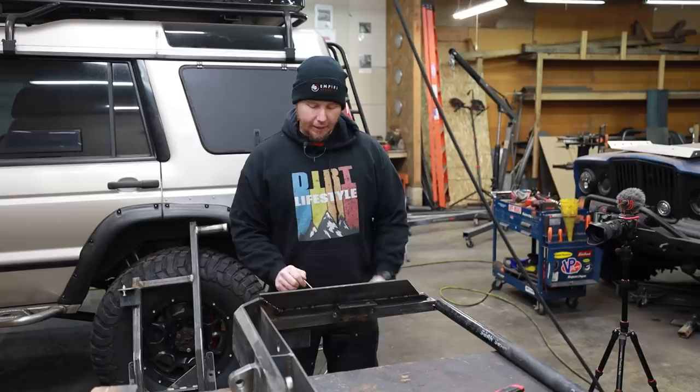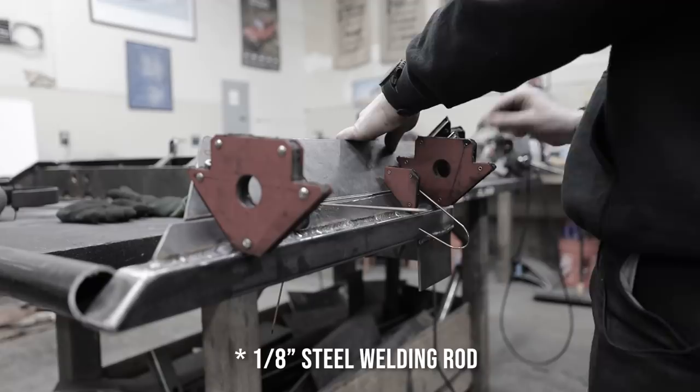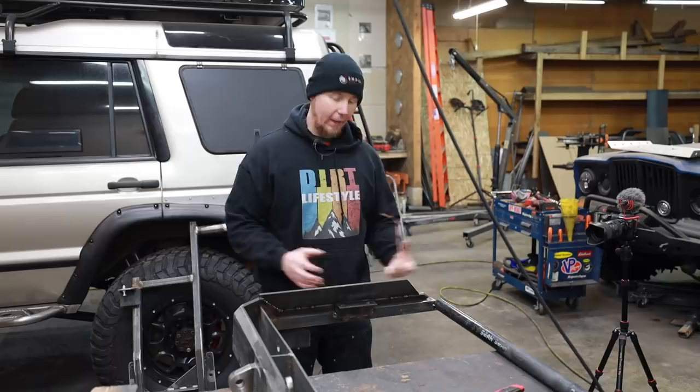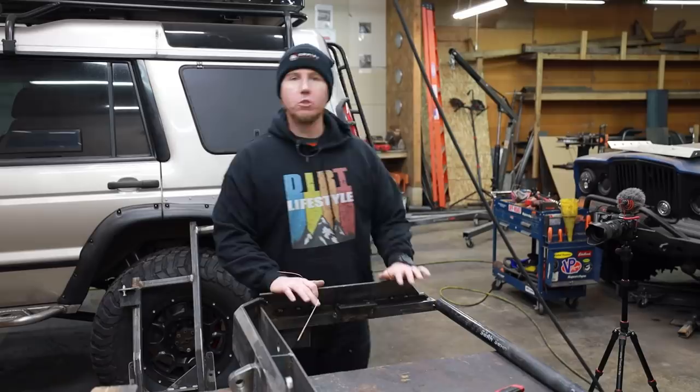The way I've discovered works best to keep warping from happening is by giving yourself a little bit of a gap for the weld to fill. I take a chunk of eighth-inch TIG rod — three pieces — and that gives us a perfect eighth-inch gap that remains whenever we tack weld this in place. Then I remove the TIG rod and we have a perfect gap. If there's enough force to bend this bumper, it'll just pop one of these tack welds. So we have a few built-in fuses here.